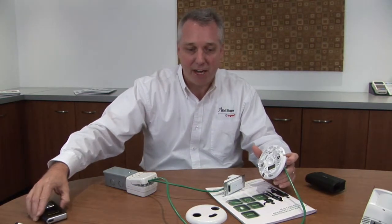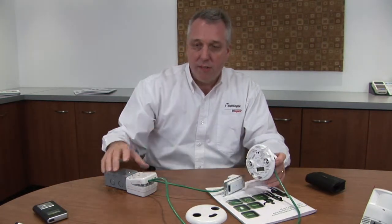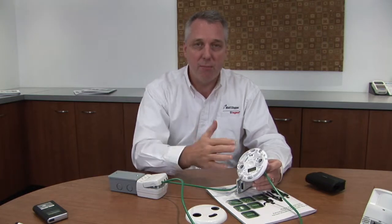That's the start of Digital Lighting Management. These devices also come with BACnet connectivity, so the same twisted pair that you're using to control your VAV boxes and your air handlers can be used to manage and control your lighting control systems. All the variables available in the room are broadcast as BACnet objects, so changing time delay, sensitivity, monitoring light levels, and power consumption are all available to the system integrator through BACnet objects.